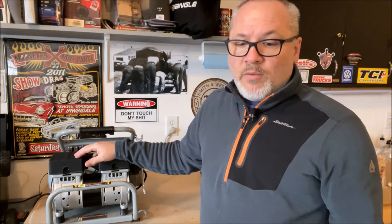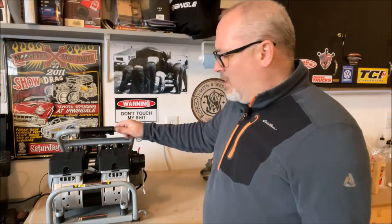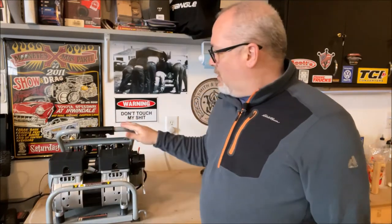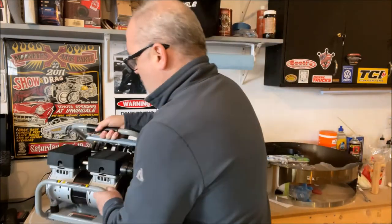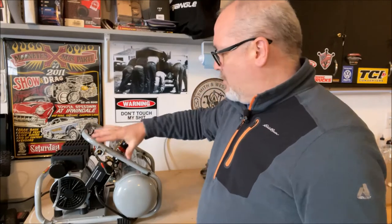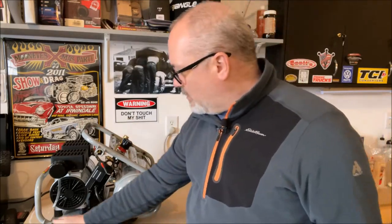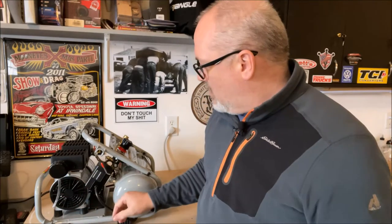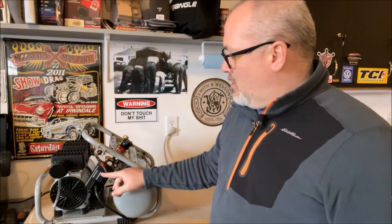Another thing I really like is the design. There's a roll bar to protect the compressor if something fell on it or you bumped into something while carrying it. The roll bar goes under the frame and up to form the handle on top. It's all built in — a welded frame with thick sheet metal carrying all the internals. It has a large industrial switch: set it to automatic or off. On auto, it fills the tank to 135 PSI, then kicks back on automatically at 90 PSI to refill.